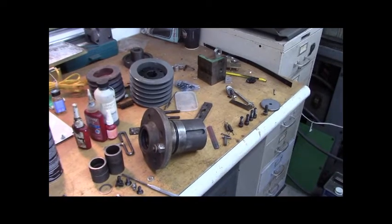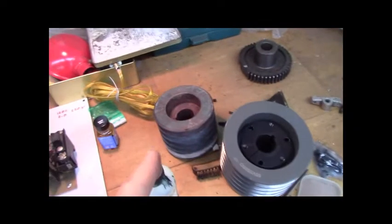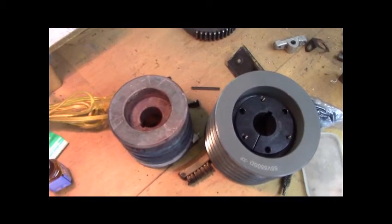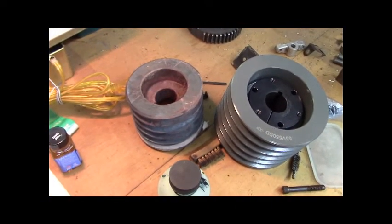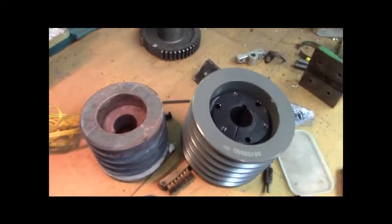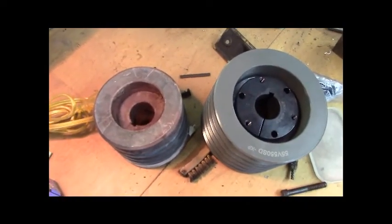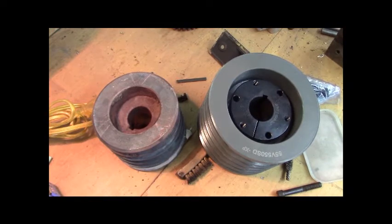The input shaft runs at high speed — like 900 RPM. Speaking of RPMs, that's the old pulley on the left that I took off the lathe. There were two hours of heating it up with a cutting torch to get it off the shaft because of the fretting rust — you can always tell fretting rust by that brick red color. Huge pain in the butt to remove, with a gear puller and cutting torch. It was more than two hours.